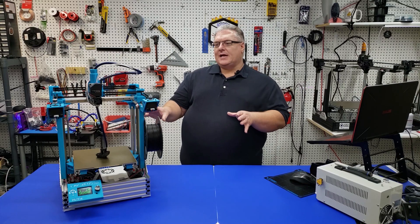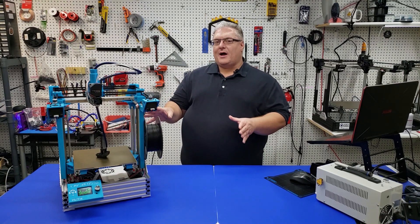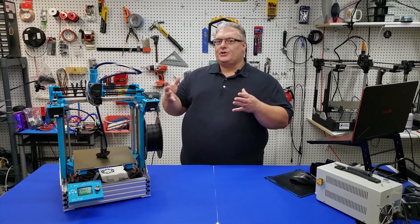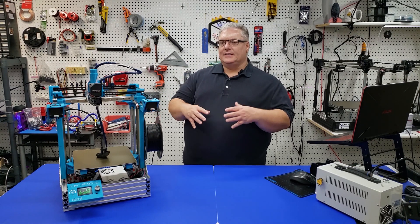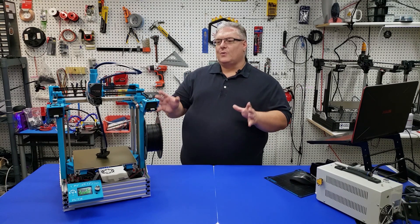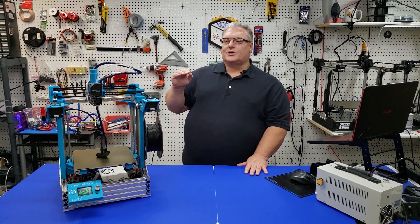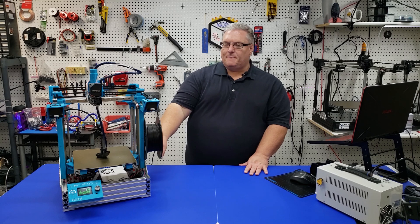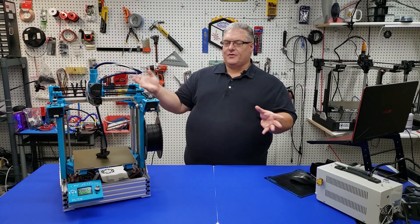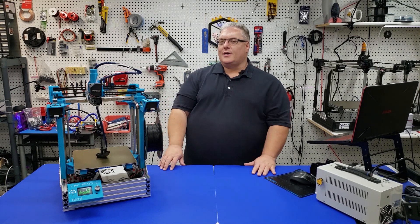Really all of the models from the X301 convert back to this X201 size. What's really great about that is that the X301 and the X201 have really become a scalable printer. There are other printers on the market where you can use a configurator or spreadsheet to generate larger or smaller builds, but the really nice thing about the X201 is that it offers you the ability to use commodity parts. The extrusion lengths for the base and the top are 300 millimeters — not an odd size like 325 or 318. They're really standard sizes, and you can even buy these parts on Amazon.